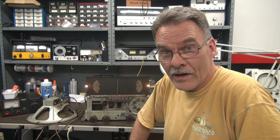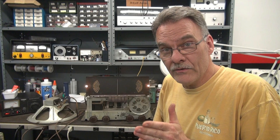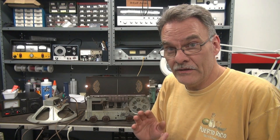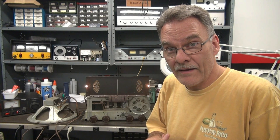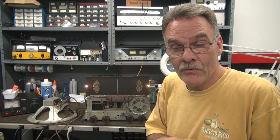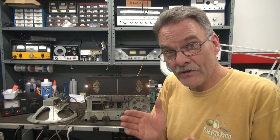The restoration is coming along well. When you get in these radios, they're full of those old wax nasty looking capacitors — you just change them. Don't think about it, change them out, and then change that main filter capacitor, because that old cap has been in there since 1940. If it fails, it can damage your power transformer, the speaker, and obviously other components in the radio. Then I have to go through and check the tubes, because I haven't done that yet. I'm sure there's a lot of other resistors that are out of tolerance, and that wiring is all crusty and falling apart — I need to address that too. I'll show some follow-up videos when we get to that point.